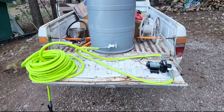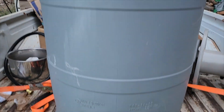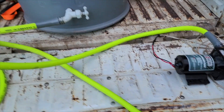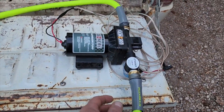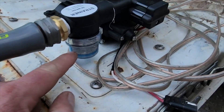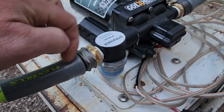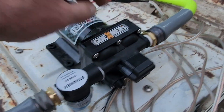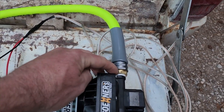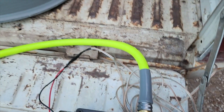So let me show you what we've got. We have a 55-gallon water drum here — fill it from the top, it has a spigot already on it. We have a Flexzilla four-foot hose that runs from there over to this 12-volt water pump. This pump goes to 70 psi and came with a little wire mesh screen. You'll need an adapter so it fits a garden hose — female to male — so you can attach a garden hose. This hose is female-to-female, and on the other side the same adapter, female to male. I put thread tape on it, screwed it on tight.